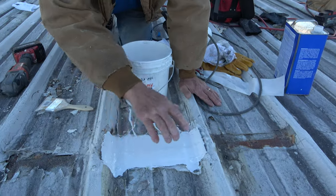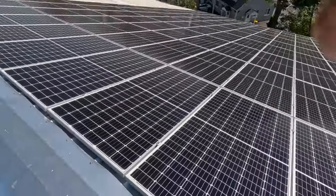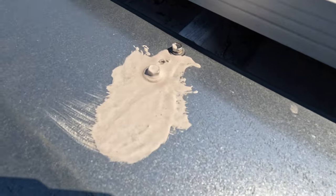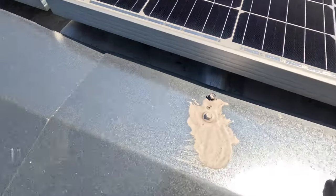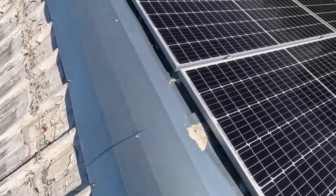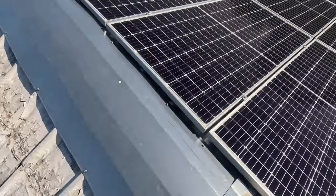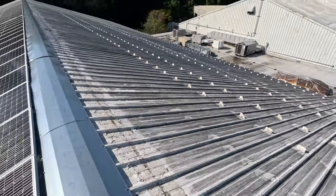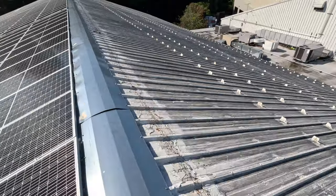To do the seam is pretty easy, and you can do the screws too — just dab the screws as well. Here's another place where we used super silicone, and this is four years ago — look at it, it is really, really nice. You can see it doesn't crack. Another spot here — beautiful, it doesn't crack around the screw. That's the roof we did four years ago, and everything looks good.